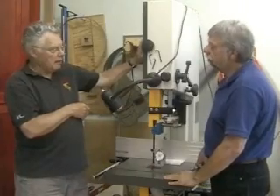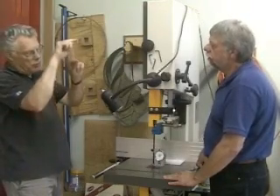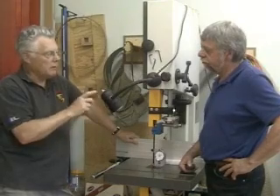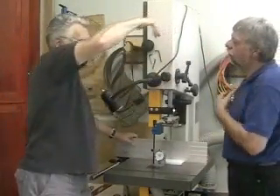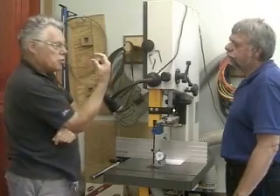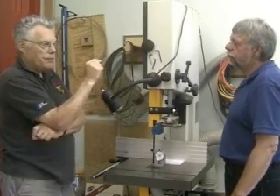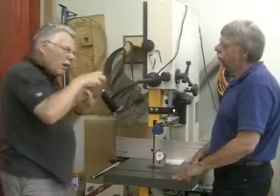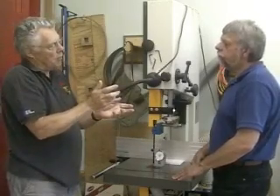Some gauges are on the back side — there's compression of the spring and everything else there, and there may be a little lever that goes up and down indicating what's going on. On a Delta saw, for example, if you've got the exposed nut and spring assembly on the back and a big knob on top with no dot, no indicator, no needle, you can gauge where you are by how compressed the spring is. You could tighten that nut right down so the spring is completely compressed and record what your maximum pressure was — at least you've got some sort of ballpark to proceed from.